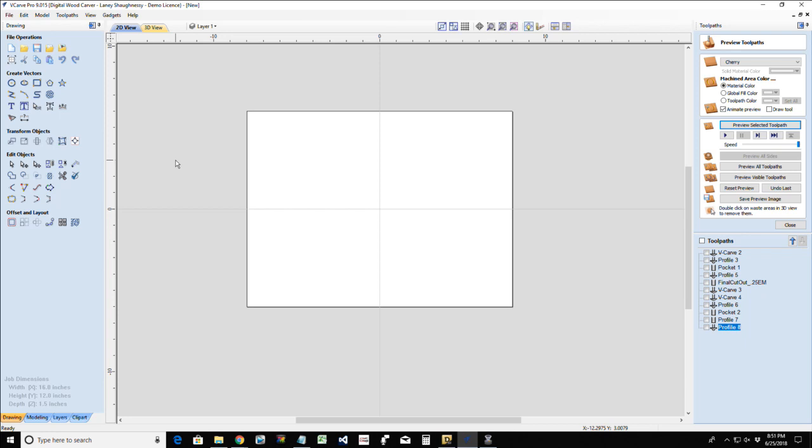But definitely check out that PDF. It's called V-Carve Inlay Project. If you type that into Google, you will find the PDF download by Paul Zank and Damian Durant, which is a step-by-step of the V-carve inlay process. In theirs, they cut to a depth of 0.3 for their female, using a 90-degree V-bit. Their start depth is 0.1 and their flat depth is 0.2, which equals that 0.3. That's going to be the only deviation from what I just taught you.